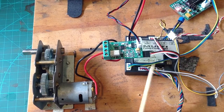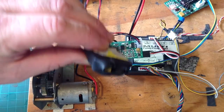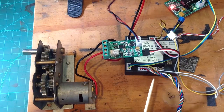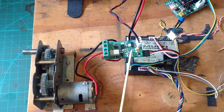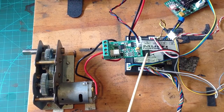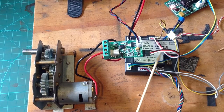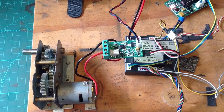You do have to change a few leads around — basically your leads for your flash unit. You pop them out of that 5-pin plug and pop them into a supplied plug here, and that goes into your Komodo board. Then you take the servo lead connection ends and plug them back into where you unplugged those leads from. I'll run through that in a separate video.